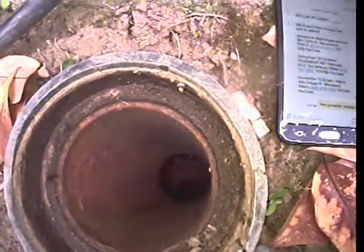Right. Express Sewer and Drain at 651 Coronado Boulevard, Sacramento, conducting TVI from ground level cleanout, located on right side of house next to crawlspace. We'll be first going upstream towards the house. We have a clay 4-inch riser leading to cast iron two-way cleanout.